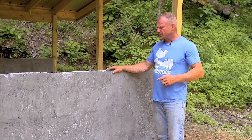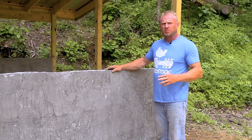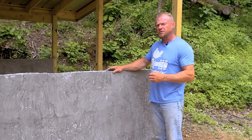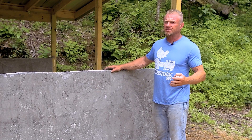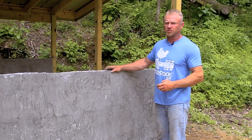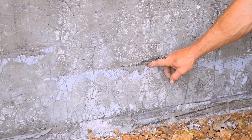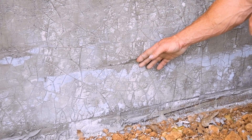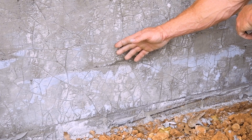One point of consideration: you can see there are some voids on these walls once you take the forms down. Aircrete seems to cure very slowly, much more slowly than concrete. When you first pour it, it's really soft. Two and three days after, it's really soft. It doesn't really get hard until it's two weeks old minimum. Normal concrete, they say, doesn't cure for 30 days, so this probably doesn't reach maximum PSI strength for much greater than 30 days. Being the fact that it stays green like that also allows you to skim coat it after it's been poured. These voids — some from where the plastic wrinkled up and some from where the aircrete didn't bond — can be easily skim-coated with a mud knife with fresh aircrete, and it bonds really well because the aircrete stays green so long.